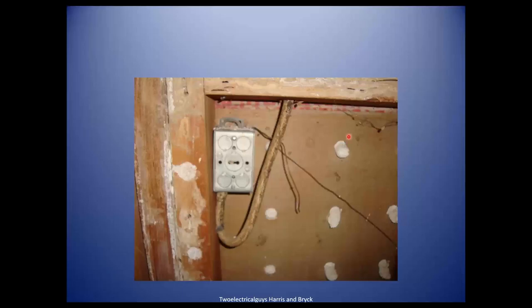Here's a copper jumper — what we're looking at is an old practice from the 1940s and 50s, where they'd run an external ground wire from box to box back to the service to give you a ground for the box, not for the receptacle. Even if you check continuity, it's not considered a good ground. It's still not a ground — this is grounding the box.